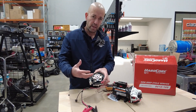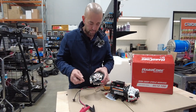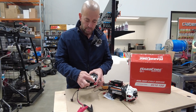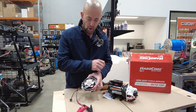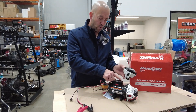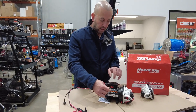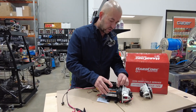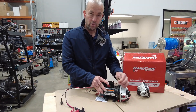When the cartridge fails, ruptures, or we have a leak in the cartridge assembly due to the degradation of seals with sodium hypochlorite over time, it'll put solution into the chamber. The idea as a fail-safe is to change the cartridge, which keeps the cost down rather than replacing the whole pump. Fluid builds up at the bottom of the chamber and covers the two circuit pins connecting to the electronic box on the top. Once fluid covers the two circuit pins it completes the circuit and we get a red fault light on the pump assembly. The detection system is plugged into the control box at the top - it looks like an old speaker wire.